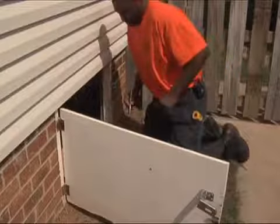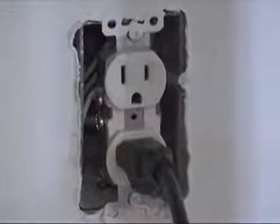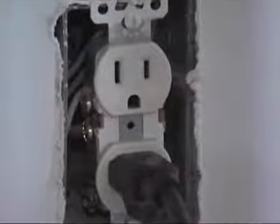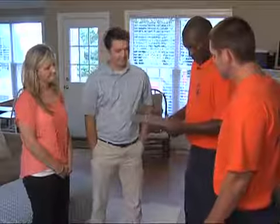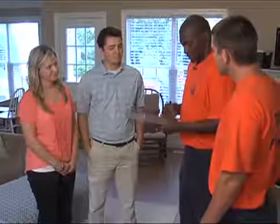As part of the walkthrough, the auditors will need to access the crawl space to look for subfloor insulation, check the condition of the ductwork, and see if moisture is present. Throughout the audit, the auditors will point out any visible electrical safety hazards such as missing outlet covers, overloaded outlets, damaged or frayed electrical cords, and indicators of faulty wiring such as discolored outlet plates.